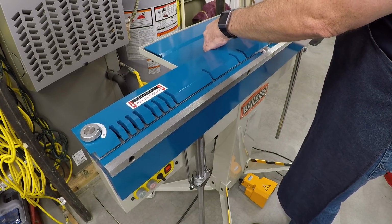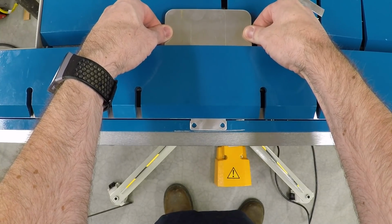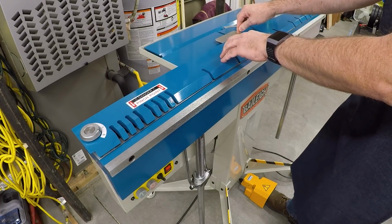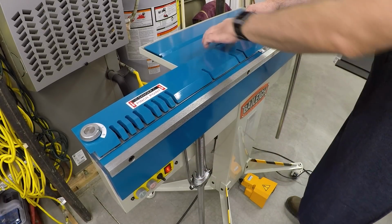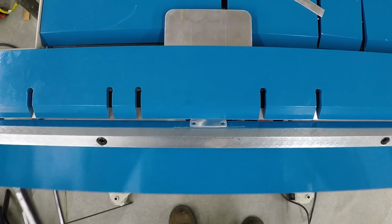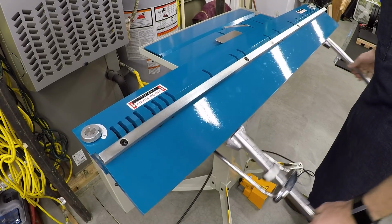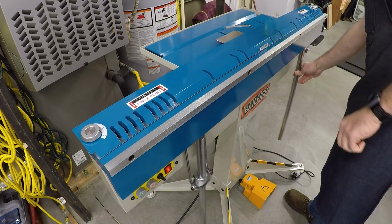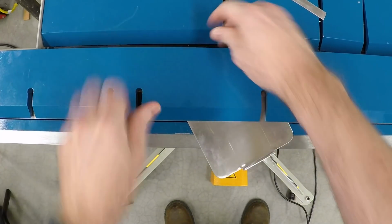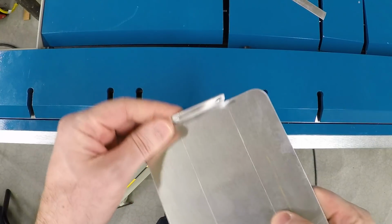Just slide it in here underneath the magnetic clamping arm, and this one I'll just align here by eye. Looks about right. Let's try turning it on. And bend this up just past 90 so it'll spring back. That looks about right to me. Yeah, it's like about 90 degrees. So that's the screw flange.